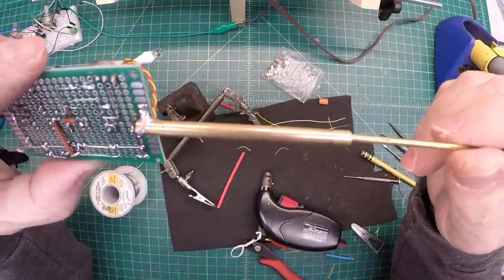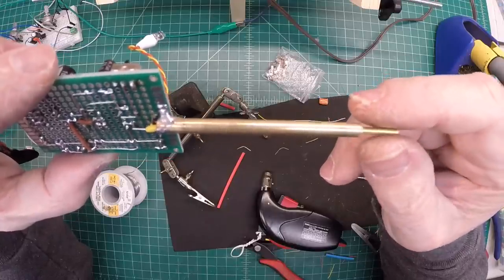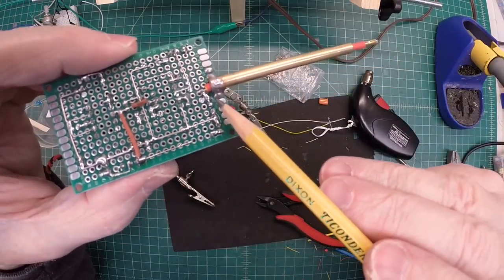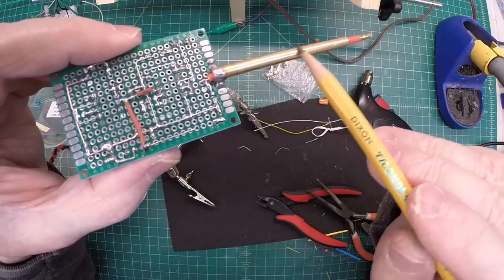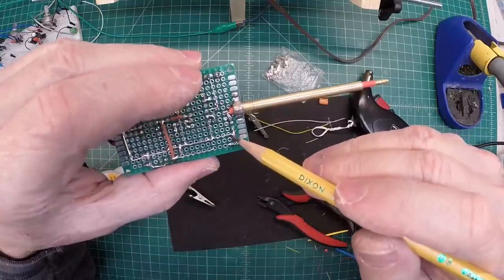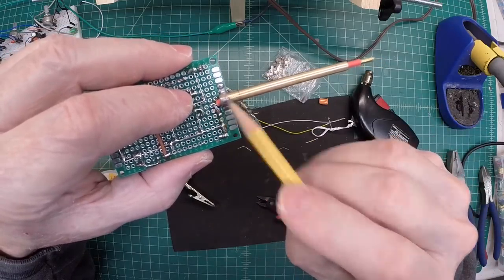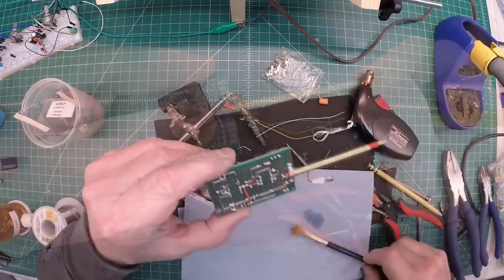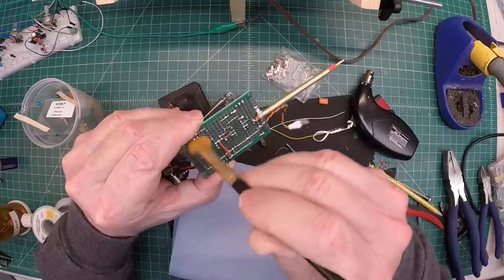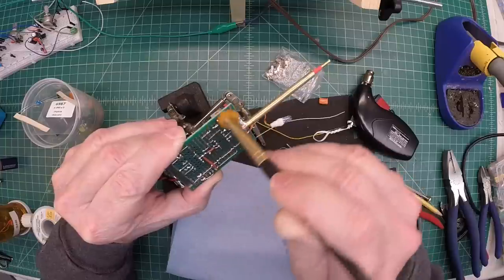You can see here just a little dry fit to make sure everything goes in the way I want it. I'll do just a little bit of trimming — a couple more pieces of heat shrink and I'll be set and ready to go. You can see how I've got the heat shrink protruding through — the diode itself resides up in this area which will be shielded. I'll tie this ground bus back into the outer shield in just a moment. Let me get this center connection soldered back to the capacitor. All my DC voltages were fine, so I'm going to take time now to clean the circuit board really well with some alcohol and get all the remaining flux off and inspect it one more time.